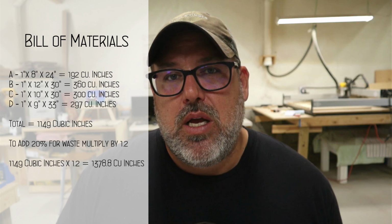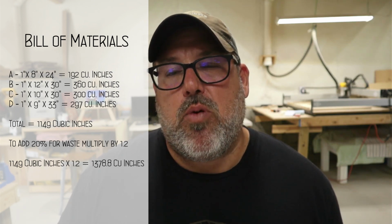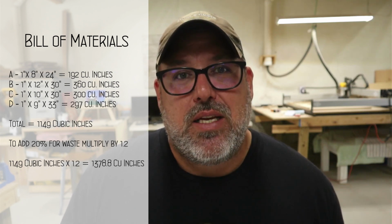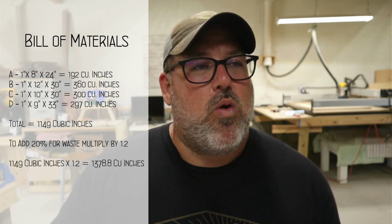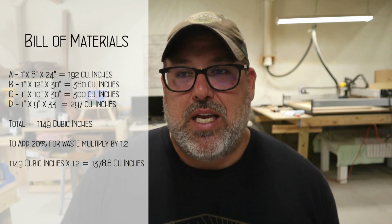Then what I recommend you doing is multiply those total cubic inches by 1.2. Now, the reason I say 1.2, what we're doing is we're adding 20% to your board foot amount. Why do we do that? Well, because you're going to have waste. If you're buying from a lumber yard, their boards are not going to be the exact width you need. They're going to be thicker than you need, most likely. If you want to get your boards to 3/4 thick, final thickness, they're probably going to come rough from the lumber yard at 1 inch.